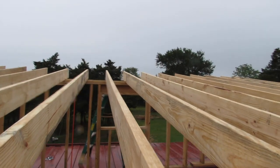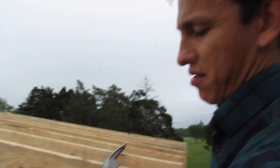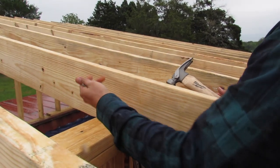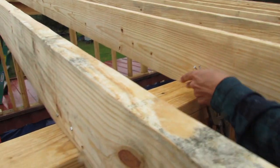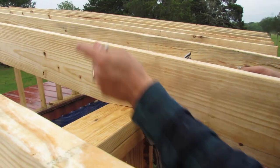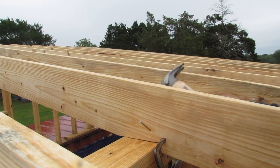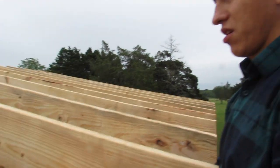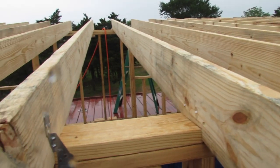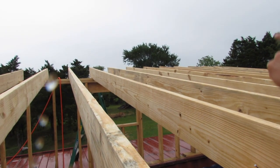It's obviously working with containers, so we're having to straighten out the walls a little bit, but it's working out so far. Why are you still hammering there if you've already gotten hurt? Because it's not that secure — they still have a little bit of a wiggle. Just putting like two nails on the side that doesn't have the hurricane strap. This side will be here, and the hurricane strap is on that side. It just gives it more security, and we're going to be putting in those blockings once we start the roof.